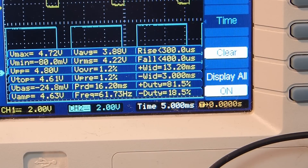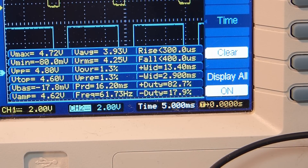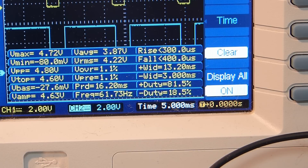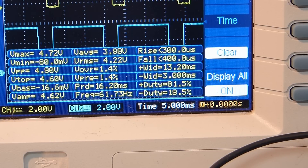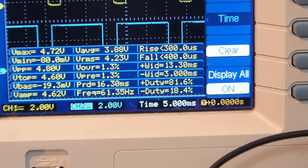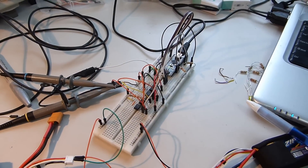So if we do 81.6 times 5,000, that gives us the equivalent voltage. What we had to do first was calibrate these, and we are using the internal built-in voltage references for both ATtinys.